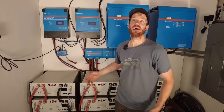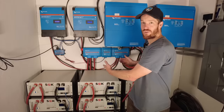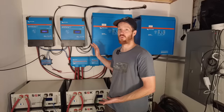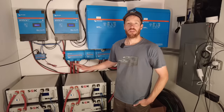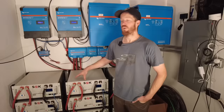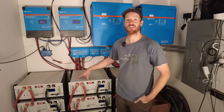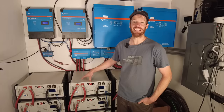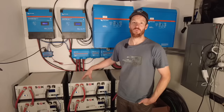And the same thing goes if we find this equipment isn't enough — we can continue adding more batteries, more inverters, and more charge controllers until we end up where we need to be. One of the most asked questions was what we expect the lifespan to be. All of this stuff comes with a 10-year warranty, but we expect it to last at least 20 years, if not closer to 30. These batteries have a 4,000-cycle rating to 80% capacity, which means that if we drained them completely dead every single day for the next 10 years, they'd still have 80% of their usable capacity left. On a daily basis, we've only been using about 20% of these batteries' capacity during the summertime, which means we should expect 8,000 charge cycles before they reach that 80% capacity point — so these batteries should easily last us more than 20 years.